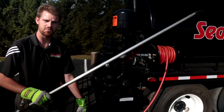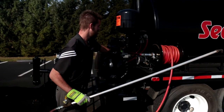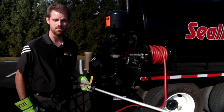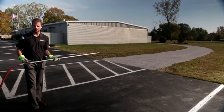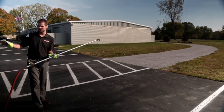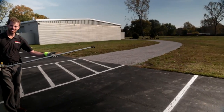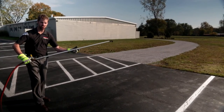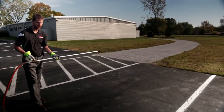My system's charged. I'm going to go ahead and charge my 75 foot of hose with my main valve here underneath my surge tank. Now I'm safe to extend my hose and start spraying. The 80 psi internal pump pressure should be just enough to raise this off my lead hand — I should just be guiding this wand with not much weight in my hand. The pressure should be taking care of most of the load. When you start, you want to make sure you're in motion.